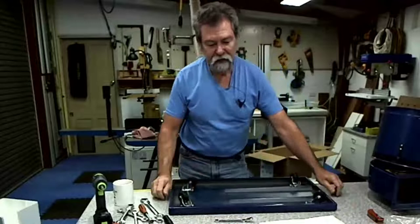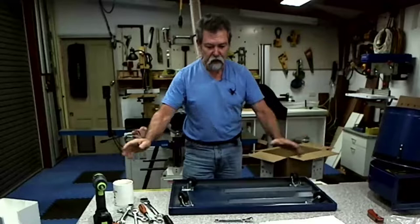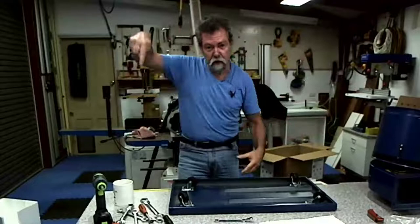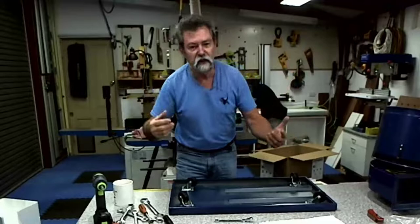So on the machine, when I'm standing in front of the machine, say this is my CNC machine here. It has two rails that go down that way that the gantry runs along. You know, like in shipyards, they've got these big gantry things and they've got a crane that hangs down. So this is a perfect example of a CNC machine. Left and right, these things are called linear rails, and that's what the gantry travels along on linear bearings.